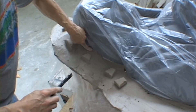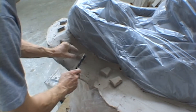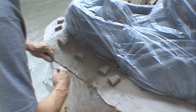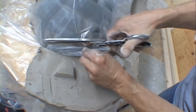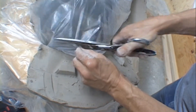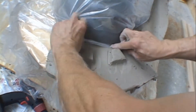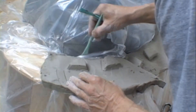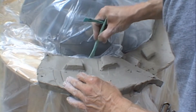When you're making your keys in the clay, take your time and make sure everything has a draft on them so that they will be able to demold easily. After you've roughed out your clay, it's time to trim the plastic back. Work the plastic down underneath the edge of the clay so that it is no longer visible. This makes clean up of your statue easier afterwards.